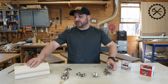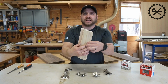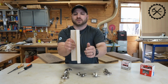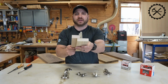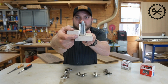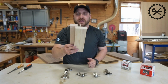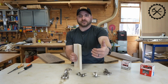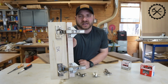Now, I will show you, this right here is already rigged up with those hinges right there. You can see the inside. Now, this right here mimics the face frame. This mimics the door. So, it opens up. Now, your 1/2 inch overlay is going to be that right there. You can see this is the face frame, and you can see the distance between there is 1/2 inch. Now that shows you the 1/2 inch overlay. If your cabinet was here, and then you open the door that way, obviously you'd have a full door here. This is just one rail piece. Opens up, and then that's the inside.